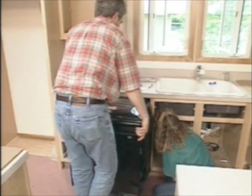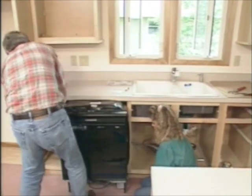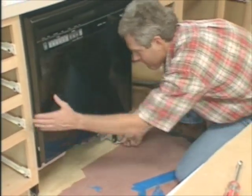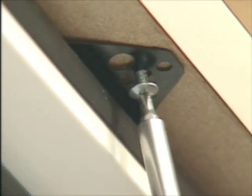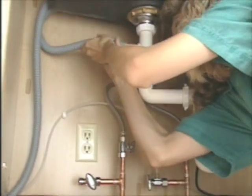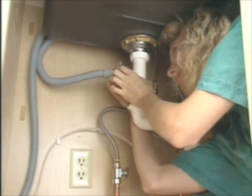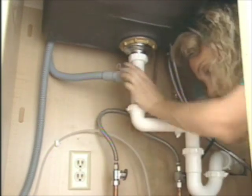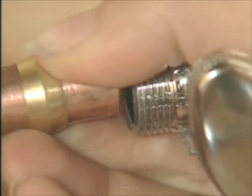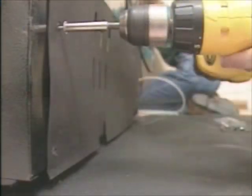It's just a matter of leveling the unit and making our plumbing connections. Once the unit's in position, turn the feet under the front corners to raise the unit up to the bottom of the countertop, then screw up through the brackets into the countertop to secure it — make sure the screws are not long enough to pierce the top. The dishwasher drain hose attaches to the fitting on the sink's tailpiece. To prevent backups, always loop the hose up into the top of the cabinet and secure it to the side with a plastic staple. A hose clamp secures the end to the tailpiece. The dishwasher supply line attaches to the unit with a compression fitting, and the other end goes into the hot water shutoff valve with another compression fitting to wrap up the dishwasher installation.